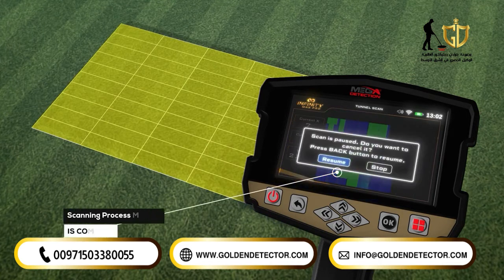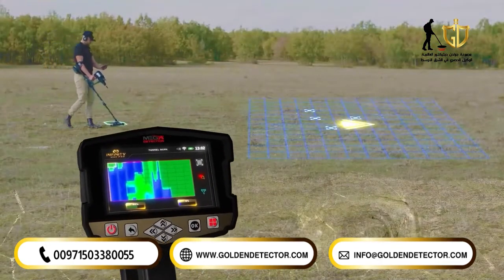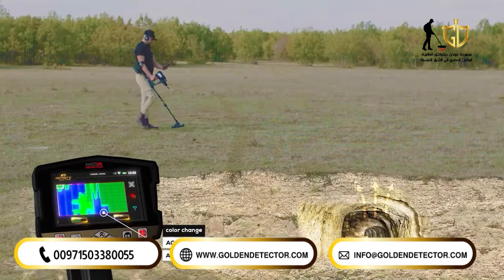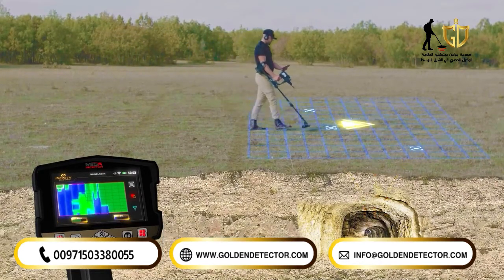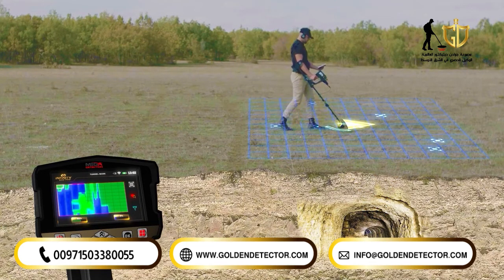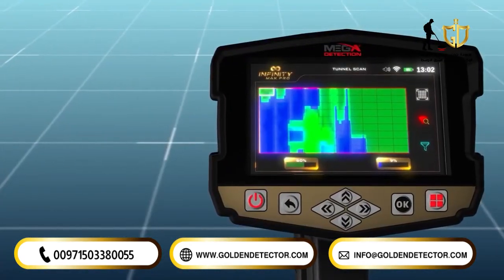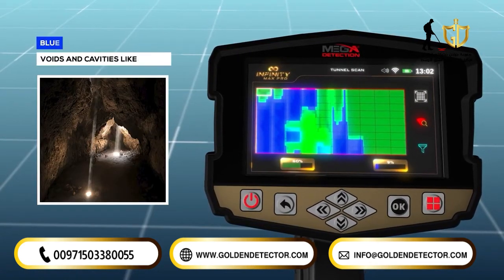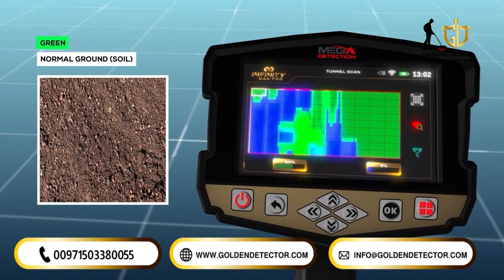When the scanning process is completed, you'll see an alert on the screen stating that the scanning process is complete. Press OK to exit. During the scanning process, you'll see the color change of each cell of the grid, according to the current scan point, according to different colors. The user can know whether there is a target under the scanned ground or not by the color of each cell. The following is an explanation of the color connotations. Blue: voids and cavities, like a tunnel. Green: normal ground, soil.